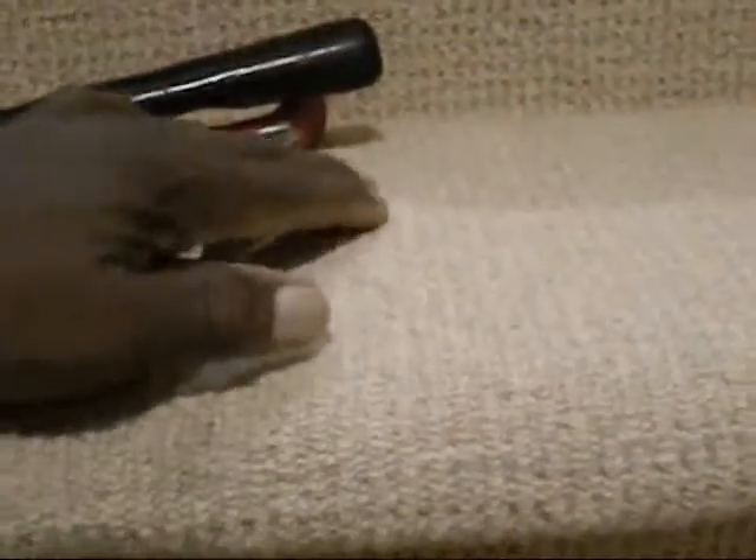The method I use is to put a piece of tackless along the side, which helps hold it. I cut back the riser on the bottom, peel it back, then take my knife and cut out a piece of padding and remove it. Then I'll put a tackless piece in there, take my kicker and kick it up to the tackless, and it'll stretch the bubble or wrinkle out. That seems to be the quickest way I've found, because you don't want to pull the stairs off and remove 2,000 staples and try to reinstall them — that just takes forever.